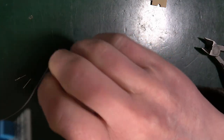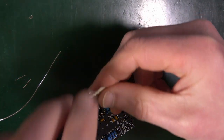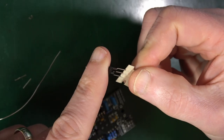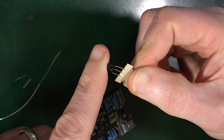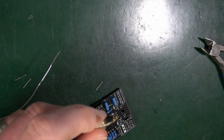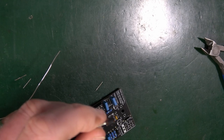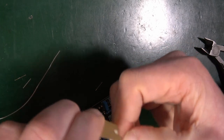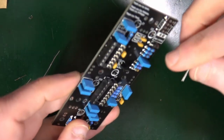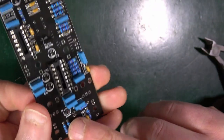And now we're going to put the transistor in. This fella. It's a 3905 or 6? 3906. The 2N3906 transistor fits the same way as the power regulator. Make sure it's the right way round and in the right place. That's what's important. So this one is also labelled on the board here, 2N3906.